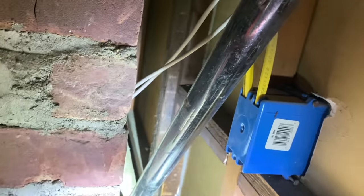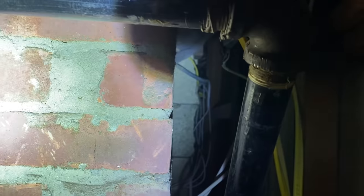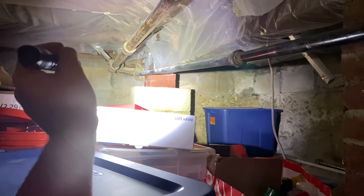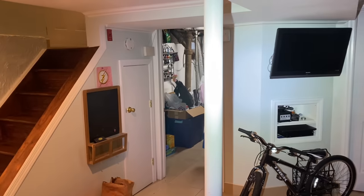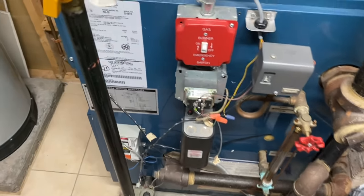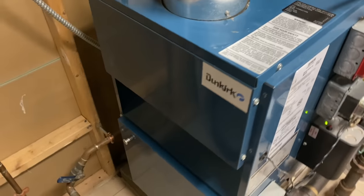Okay, it goes. Oh, no, I don't want to step on that. Oh. It goes down there. All right, so he's got a brand new wet return that he replaced underground. This line pitched all the way back to the boiler like that, but you want it to increase headroom and put the line underground. All right, I have the client gonna turn on the, raise the thermostat up and fire up this boiler.